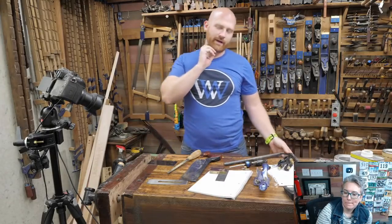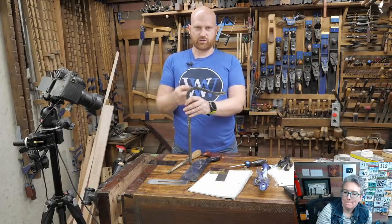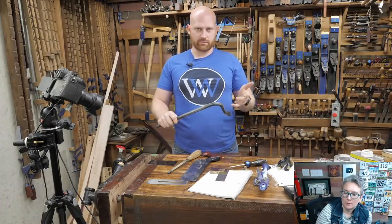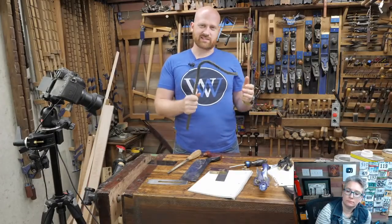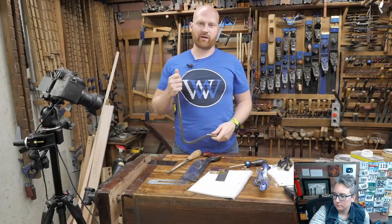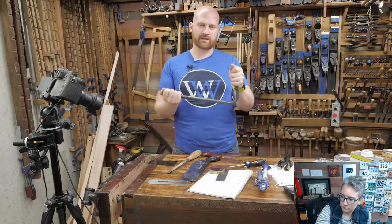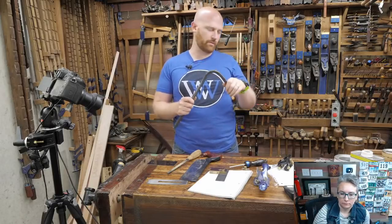There's basically 3 types of holdfasts. Number one, you can buy the cast holdfasts, and you'll see that the top has this squared corner, and you can tell that the whole thing has been cast. So it isn't forged, it's cast. And those, number one, usually have a coating on them, and they tend to slide a bit. Number two, they will often break. And the 2 that I used to have both broke. I get the comment quite often: my holdfasts keep breaking, what's wrong with them? Don't buy cast holdfasts. You'll see them with this square corner up there most of the time.